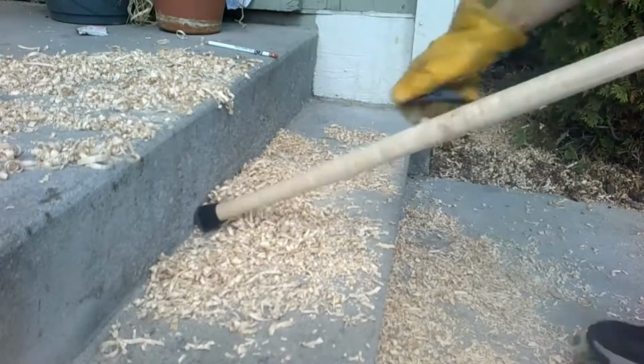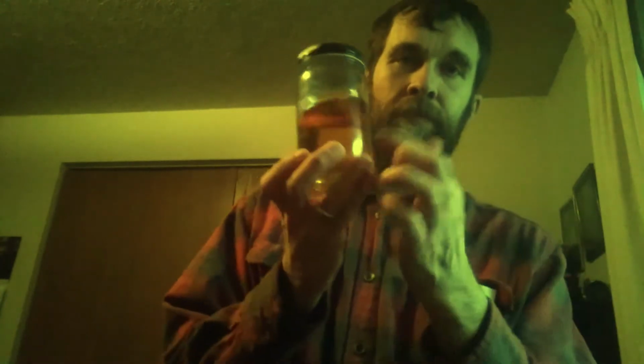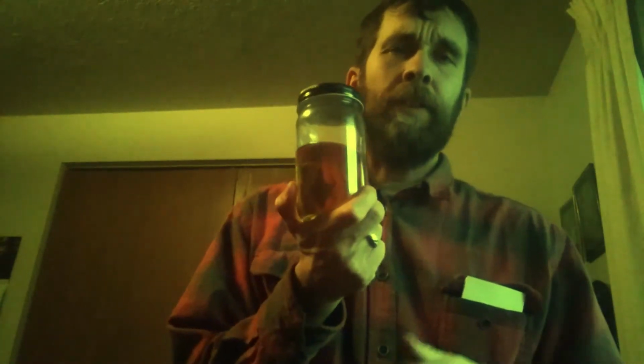The difference between a surface coating and a non-surface coating one, but I'm going to stick with why I switched. One of the key things is that the reason I switched to this flaxseed oil, by the way, is I noticed it was penetrating a whole lot deeper. Boiled linseed oil, on the other hand, wouldn't penetrate. I had to do several things, mineral spirits and all this stuff, and add more chemicals. I tried it on a blank piece of wood, and it was still, there was nothing.